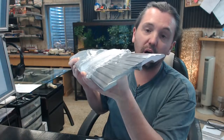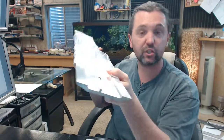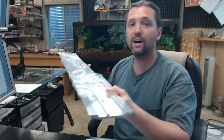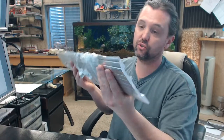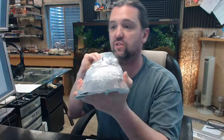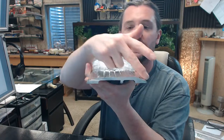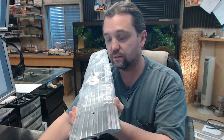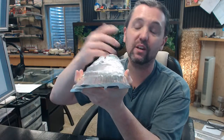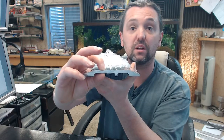As you can see from this video, this is a substantial piece of aluminum. This 3-foot piece weighs over 5 pounds — you can see how thick that is. The HD is simply a reference to the fact that this is their 425 threshold, a saddle type threshold, but HD means that the wall thickness is .244 thick, so it is basically a quarter-inch thick solid aluminum.